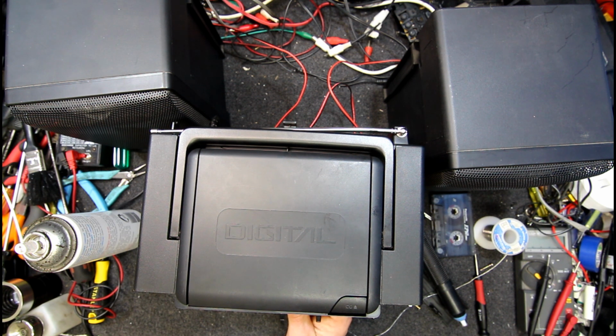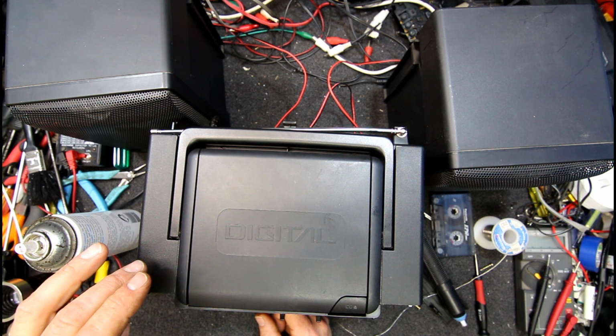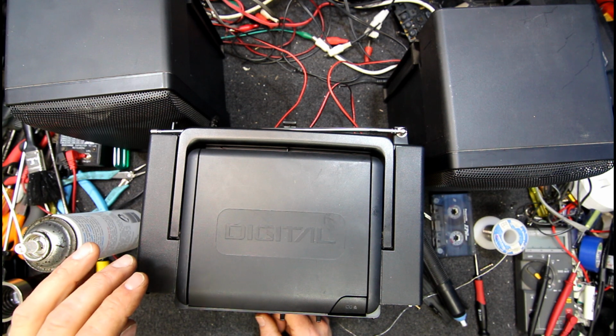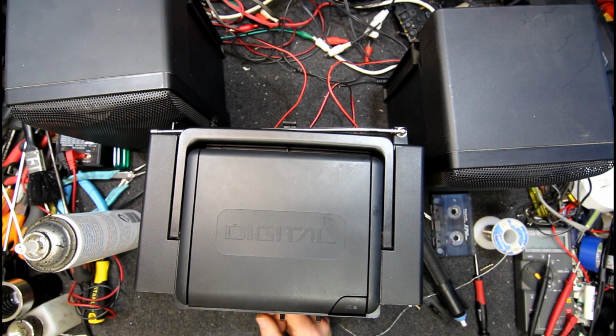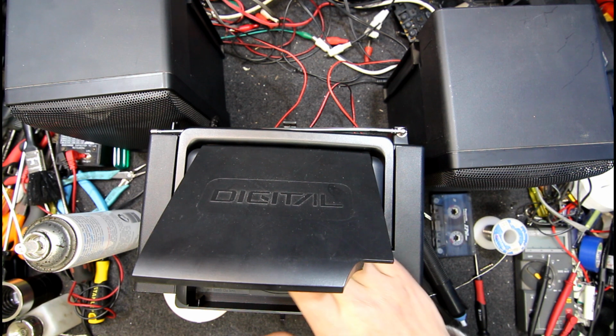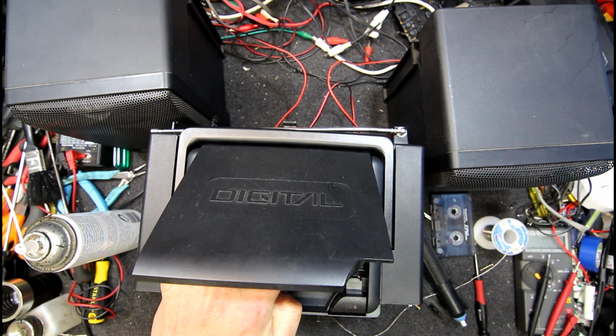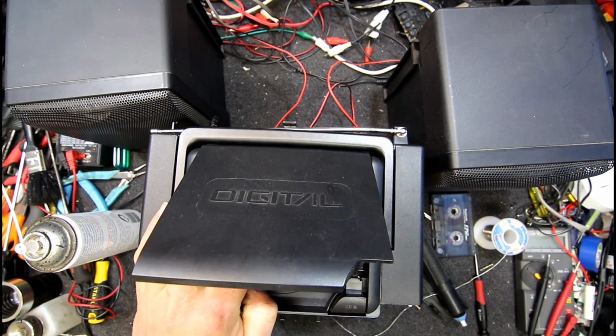Let's try it earlier in the disc. Yeah, a bit picky. One thing to check, I guess, is that I did actually get the laser sprung alright. Seems to move around alright. It's a little stiffer than I would have expected, so it could be that those rubber mounts are starting to go, which is another thing that does fail in these things.